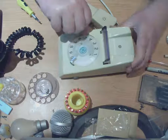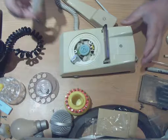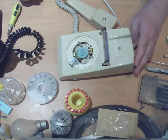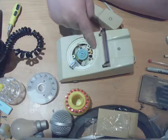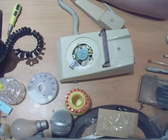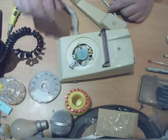At this point you can get the dial face off if you want to. The easiest way is to just tip the phone upside down and it will just fall off in your hands. And this is where things differ a bit from a normal 746 or a 706, because trim phones used to have illuminated dials. The way the dials illuminated was by this tube that goes around here. This is a little glass tube that was basically originally radioactive — it was a material called tritium. It was radioactive and it glowed, as all comic radioactive things do. The tritium really did glow with radioactivity, and that is what gave the dial its glow — that is what made it light up at night.